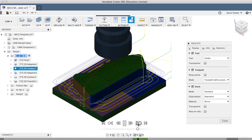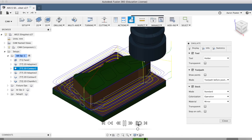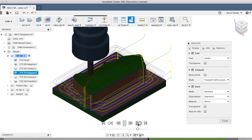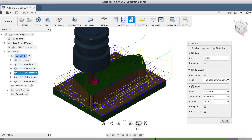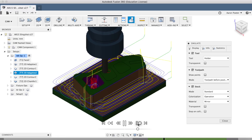Now we're going around with the 2D contour and I'm going to repeat that finishing pass just to clean up any little nasties left over from any tool deflection. Going into those holes now with the 2D adaptive boring strategy — I've actually upped the ramp and plunge feed rate here a little bit.